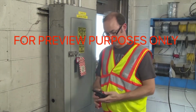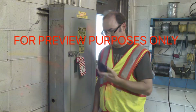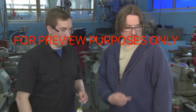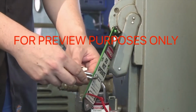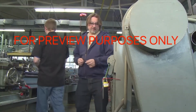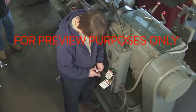In some special situations, additional procedures must be followed when locking and tagging out a machine. One of the most important of these occurs if you have a personnel change during the time the equipment is being serviced. In these situations, it is important to maintain continuity of responsibility. First, personnel from the new incoming work shift must install their lockout-tagout devices. Then, the locks and tags that were installed by the departing work shift should be removed.